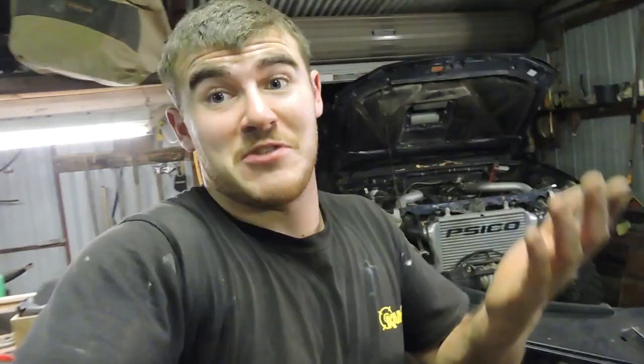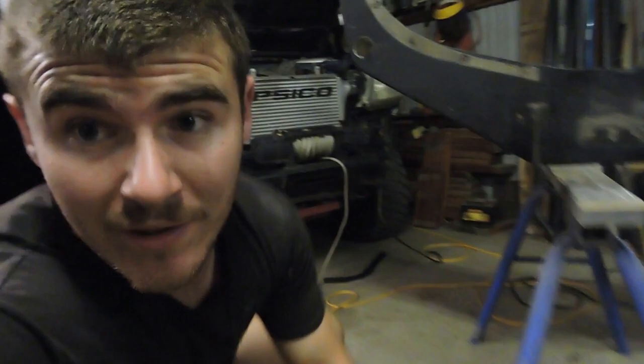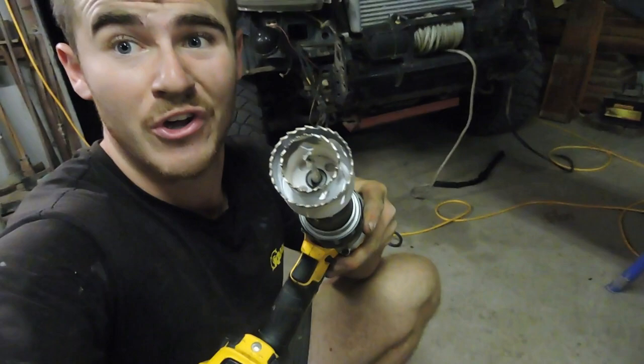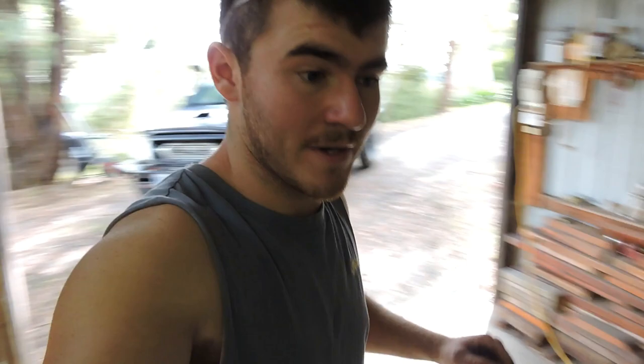I attempted scrub bars a while back and absolutely botched it, so we're going to do a bit of a redo and see if we can't get it to look good. Just in the process of drilling out the old holes. All I've done is got myself my hole saw cassette, put a centre in for a guide, and the outside actually sits over that really snugly. Just took some time to drill it out, cut the weld off, and all we do is weld on a flat now. I'll patch that hole with a bit of plate.